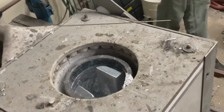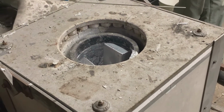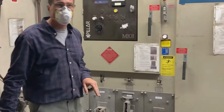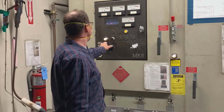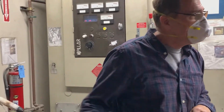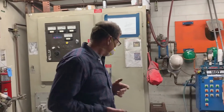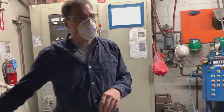Okay, what that is... okay, it didn't like that. It was very cool, but it didn't like that. So I just reset it, so it should be okay. If it sees something while it's running, like a big fluctuation in its current, it shuts down. So what was going on there was the eddy current was actually arcing. I've never seen it that powerful, that's pretty cool. Probably not good for it though. Smell a little bit of brimstone there. So that's not how you want to melt.